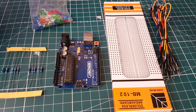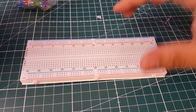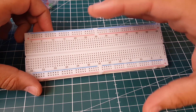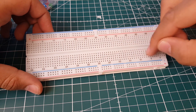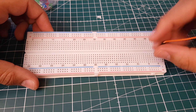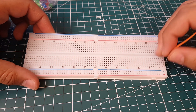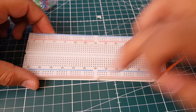If you're new to this, let's quickly talk about the breadboard. There's a bunch of holes and it can seem complicated, but it's actually super simple. In the middle, if you put one wire — let's say five volts — that means all the holes in that row are five volts, and you can connect to whatever you want. That's how it works all the way down the middle.